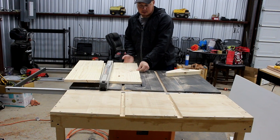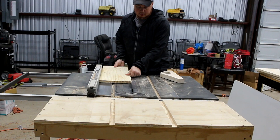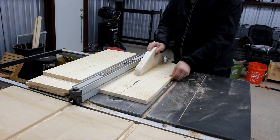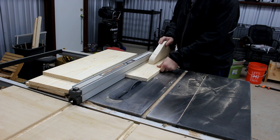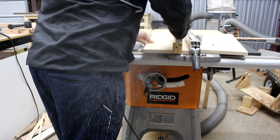When I do all my work at the table saw, I like to take the rounded edges off. I trimmed off one side of all my boards before coming back to cut them to final width. The final width for these drawers is about three and seven-eighths inches, and here I'm cutting them to final width on the table saw.